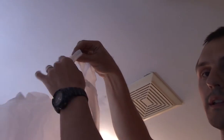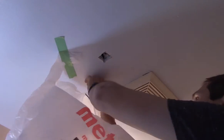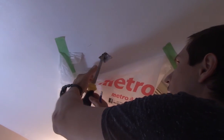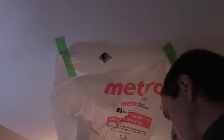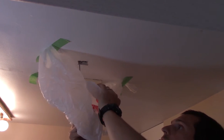Last thing to do is put our diffuser in the ceiling. A couple of tips: one is you could run your vacuum by your keyhole saw. I've got another trick — I took a plastic grocery bag, cut the handle, cut a slit down the side, and I'm going to create a little pouch on the ceiling with some painter's tape to catch the drywall dust. Before cutting the ceiling, we want to poke around and get a rough feel for where the edge is. Looks like it's pretty close to bang on in the middle, so I'm going to put the keyhole saw in the bag and cut the ceiling out.